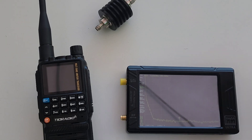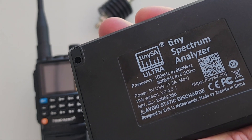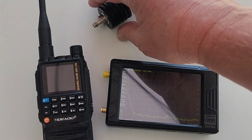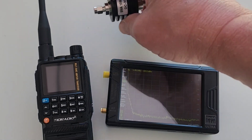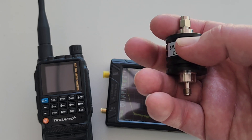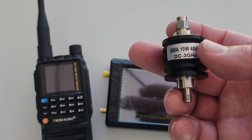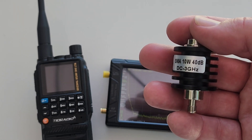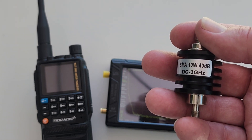To do these tests, I use a tiny SA-Ultra — I'll put a link in the comments below where you can get this on Amazon. I use a little 40 dB 10-watt attenuator, take the antenna off, and run it in. Now, this is not exactly how the FCC-certified testing agencies run their tests, but absent a clean room or a perfectly RF-silent room, this is a pretty good amateur kind of test to look at how clean the radio is.